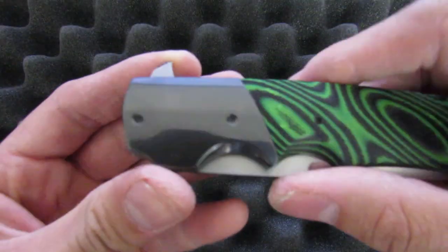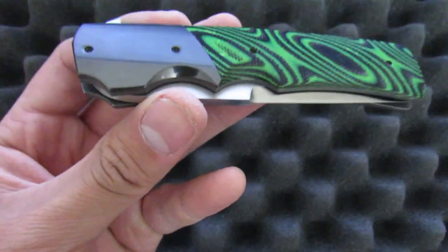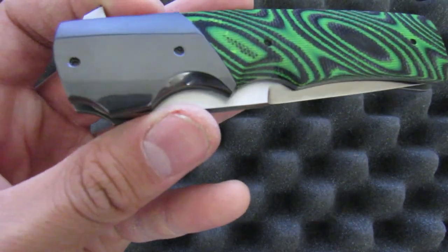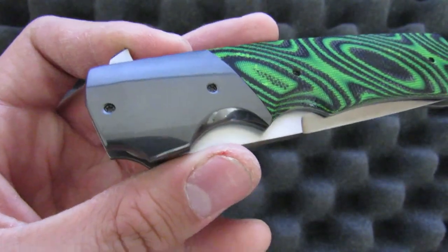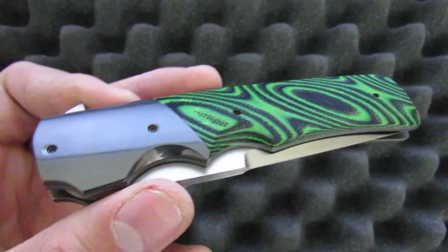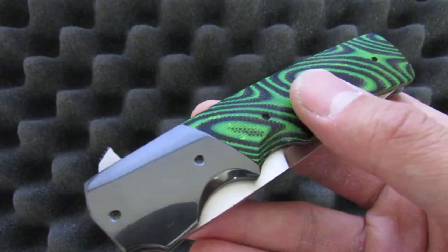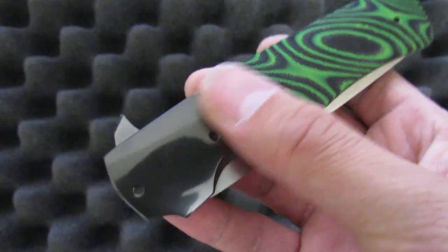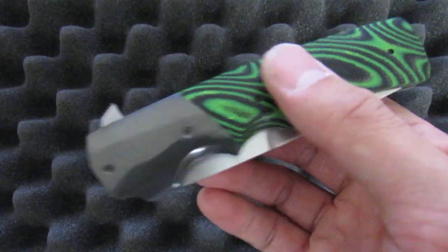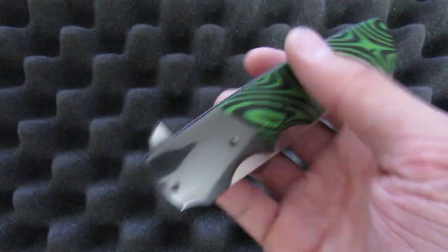Let me close this up. Come back here and you'll see a polished zirconium bolster right here. Zirconium is a great material — it's one of my favorites. You can't really get titanium black normally, but with this stuff it's pretty easy. All you really need to do is heat it up and you get a nice even black. You can even do it in a lot of different finishes. Polish it and you get that perfect shiny black that you see right there. The thing you'll notice is that the pivot isn't really visible from the front. Jason does a lot of bolstered knives, and on those he always hides the pivot underneath the bolster, which gives the front a cleaner look than what you'd normally see.